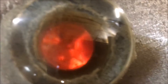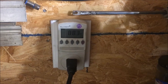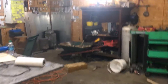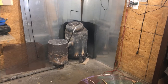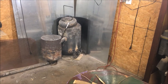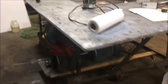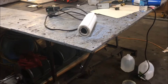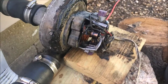You can kind of see where the air is coming in by that blast right there. We'll do about 75 watts and go outside to take a look at the blower setup. Now the blower setup you're about to see was set up on an emergency basis — my other pipe clogged up with ash and moisture because I turned the blower up too high. So I had a pot of smoking, burning wood with no blower, and I had to hurry up and throw an emergency blower on, which was laying underneath my table after having been cleaned up last year.